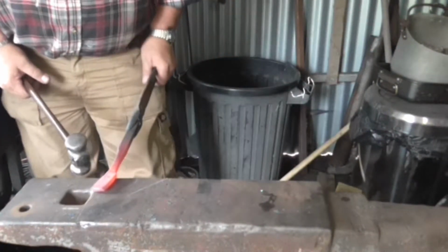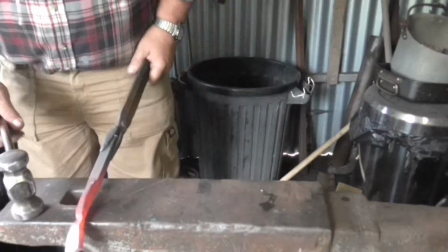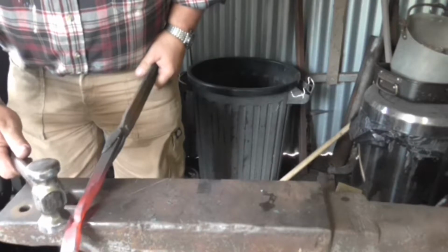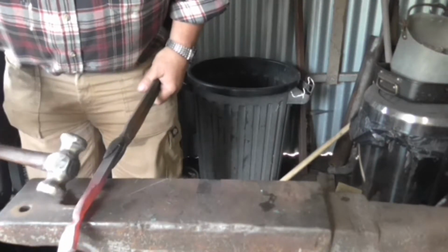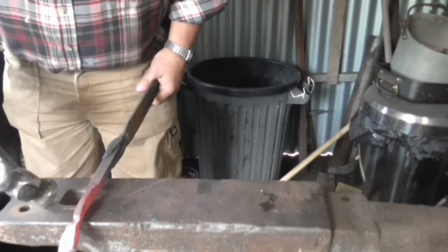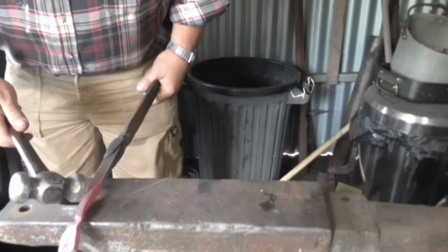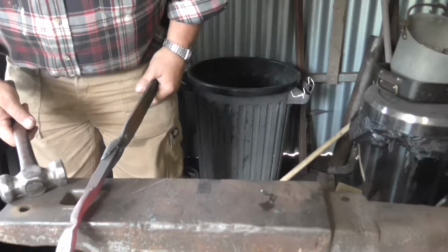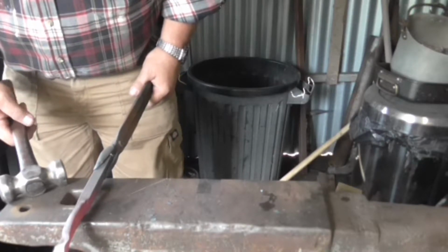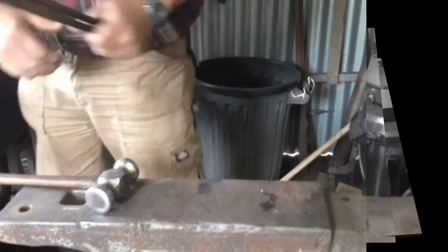Out the fire, 1, turn left, 2, turn left again, get that hinge, get that 45 degree on the edge of the handle, look at your chalk mark, you've set at 30, then look for a mark here, be it a bit of scale or whatever, then move the piece forward to the edge of the handle and set down again, half on, half off.